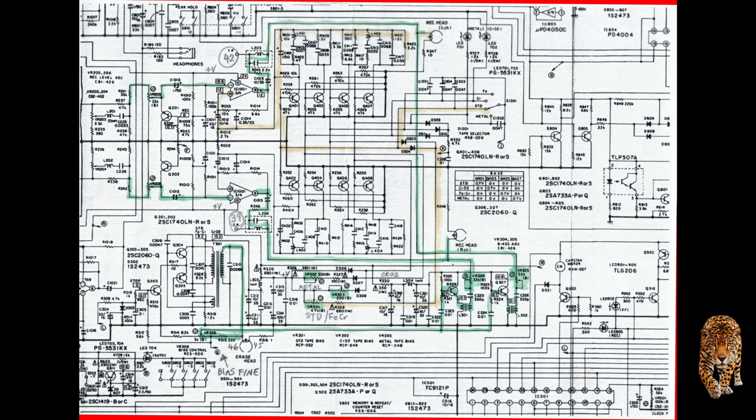A Dolby level tape. Now, this depends so much on the player as to which tape you use, but you can use the same TAC Dolby level tape for each of them, provided you readjust the reading to compensate for the different nanowebers per meter. There's 160, 200 and 250 are the main types of level tapes you can get, and I adjusted the level for this accordingly to what it needs to be. Refer to the other videos.